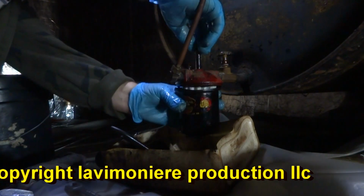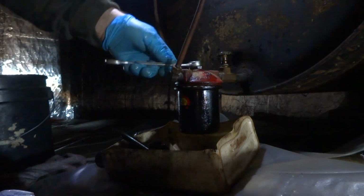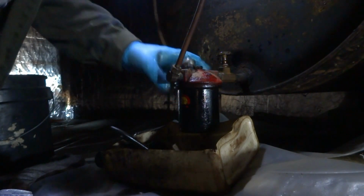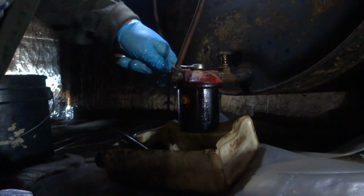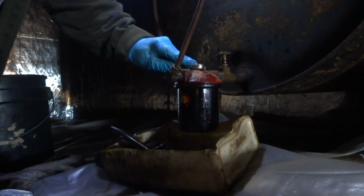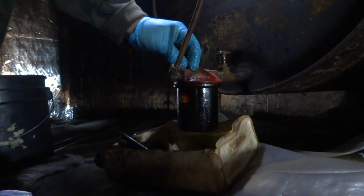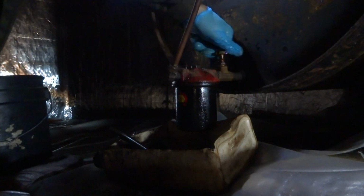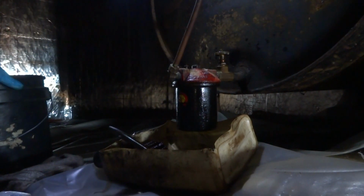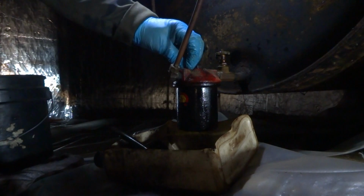What do they call an F1 or a general filter. This is a general. You can go with the felt gaskets if you want. I'm good with these. I have to bleed it all out here good. Tiger loop self-bleeding upstairs. You gotta bleed everything through this little bleeder here.